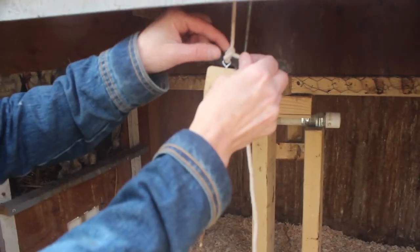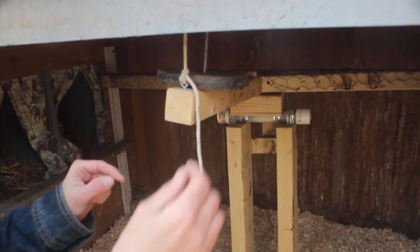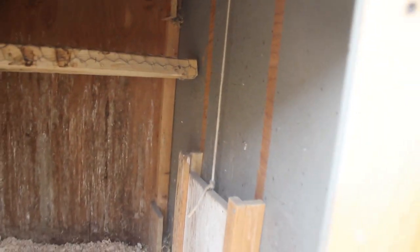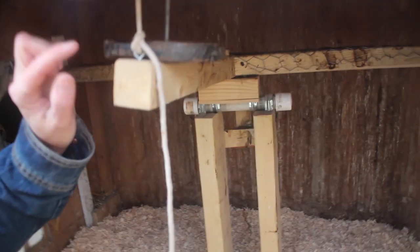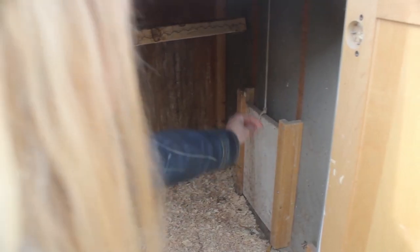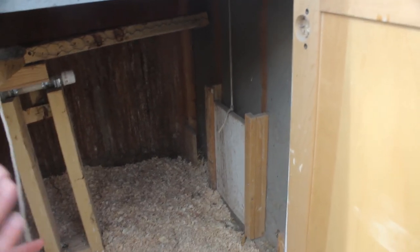I have this little rope tied to the eye hook at the end of the automatic door opener, and then it's attached inside to a pulley. And then from the pulley, it goes to this little cup hook. I only have one pulley, and then it's attached to the top of the door. So basically, once this goes down, it goes up to the pulley, over to the eye hook, and down to the door. Notice the door is just free-floating — it's not attached, which means there's not a lot of friction, so it opens and shuts easily.